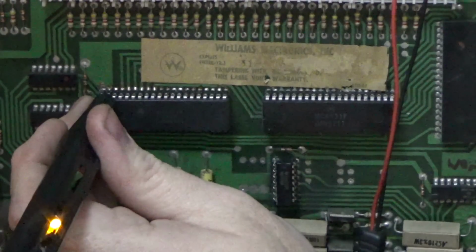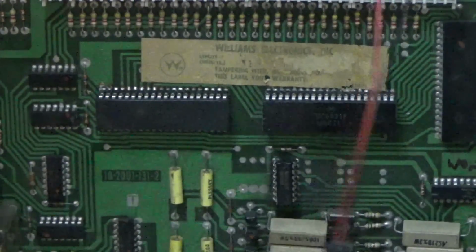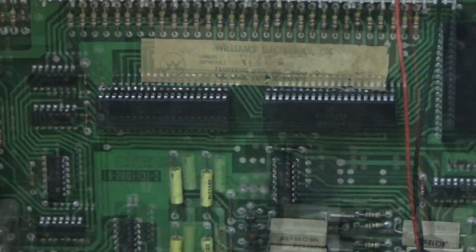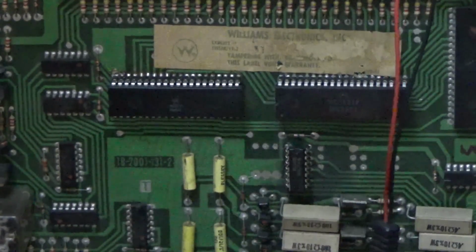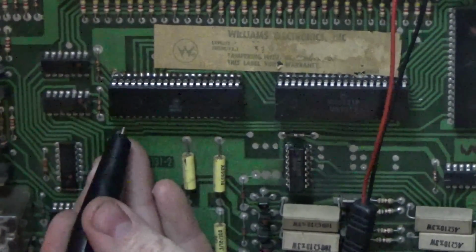And then 39. 39 is working. I think that chip's bad. Pin 5's messed up, man. Let me see if I can swap another one in, and then we'll test it. All right, I popped another one in. Now, it could be the input is messed up. It also could be that the logic chip that connects to is messed up, but we'll see.